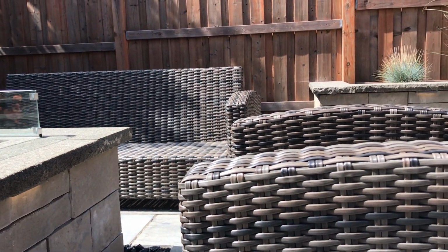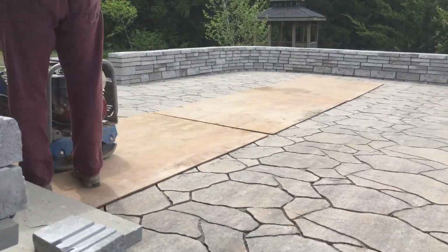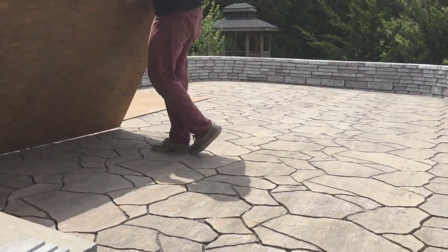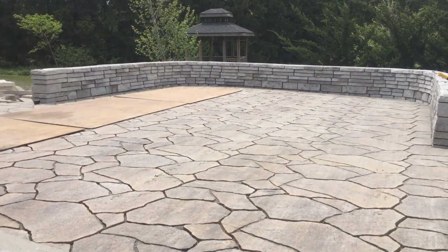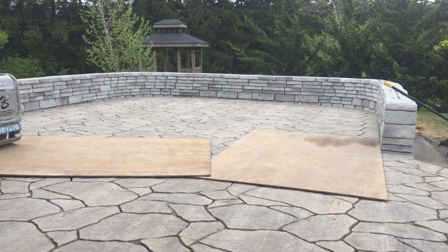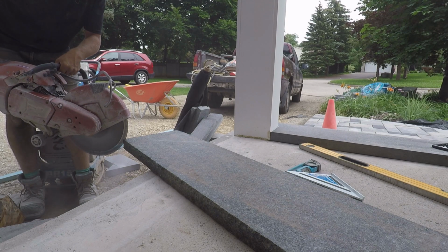Functionally, it increases a weak point in that cap or paver section that is coming to a point, and those can crack under load, especially if it's a paver border and you're going to be compacting it with polymeric sand consolidation or just the jointing compound. That is a point of weakness for that to crack, or even in the future, those miters present points of weaknesses that may crack in the future.